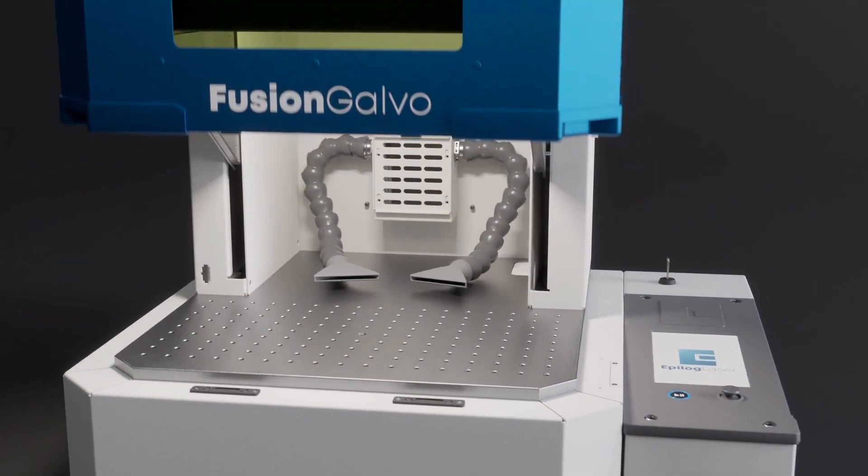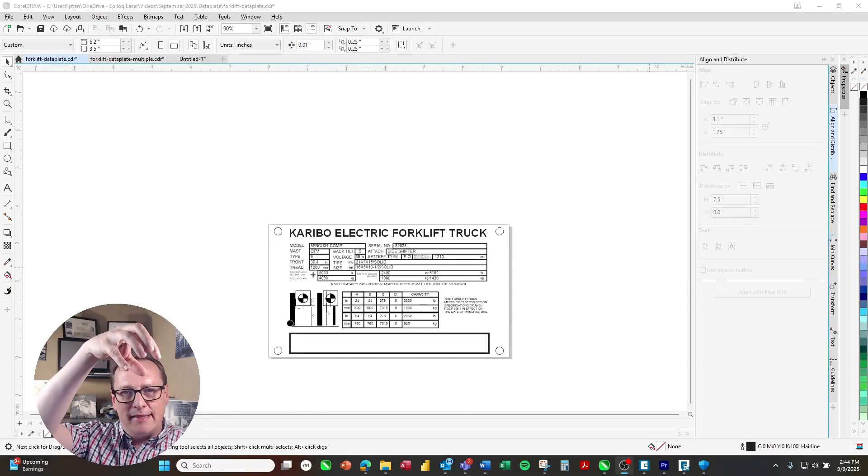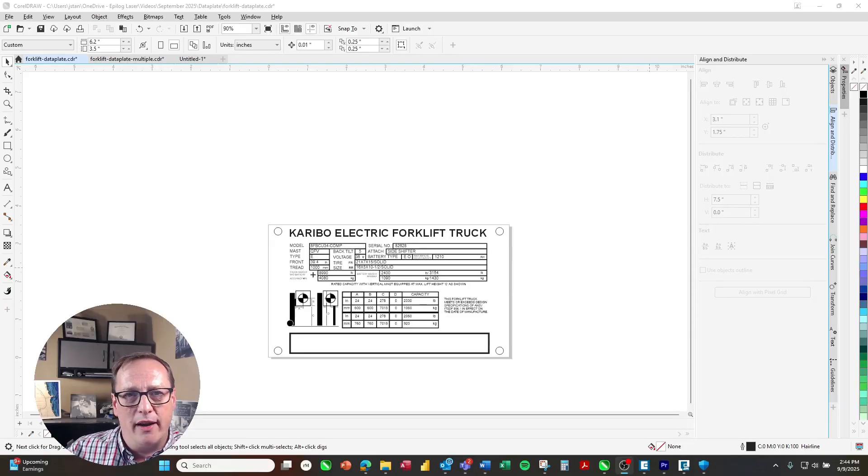For this next example, we're going to be using the Fusion Galvo G100 fiber laser system. This is a little bit different than the flatbed — it uses a different laser source. Whereas the other piece was using a CO2 laser, this is a fiber laser, so this is specifically for metal etching. The CO2 laser is great for all types of materials like wood, acrylic, plastics, and coated metals, but you won't get a good mark on bare metals. A fiber laser gives you the option to do bare metal engraving as well as anodized aluminum. The Galvo refers to how instead of the laser head moving back and forth like on a flatbed, it's situated at the top of the machine and quickly moves mirrors to achieve very fast engraving. You are limited to a six by six inch work area, so there's a little more limitation on how many you can do at a time, but you can have an operator constantly switching pieces out or use a jig setup.